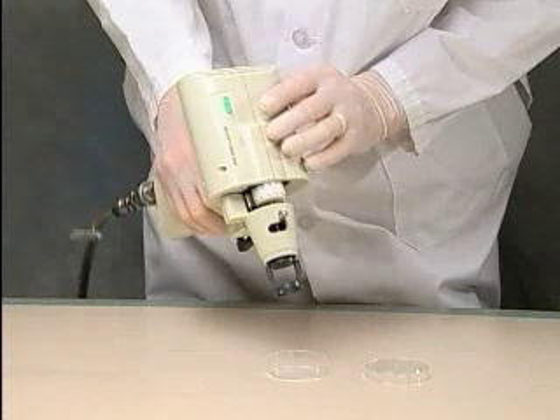Caution! Hearing and eye protection should be worn. Firing the gun produces a sound wave of about 108 decibels at 400 psi. Before using the gun to fire samples, it should be loaded with an empty cartridge holder and fired to pressurize the helium hose and internal reservoirs of the gun with the correct helium pressure. Firing the gun without a cartridge holder in place can result in blowing out the O-rings.